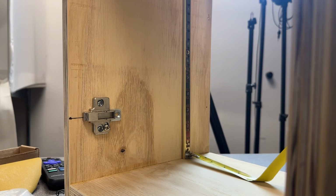Now, after you're done installing the pilasters in your desired location, all that is left is just measuring for a shelf. Just measure from the left to the right pilaster for the shelf length, and then measure the front to the back of the space for the shelf depth. Next, either have someone cut down a few shelves for you, or with those dimensions, head on to the local hardware store and purchase some cut to size shelving. Put the shelf clips in the location that fits your needs, place down the shelf, and load it up.